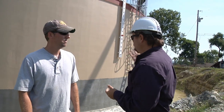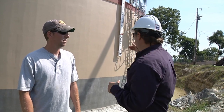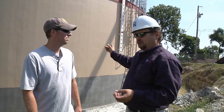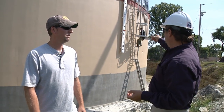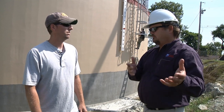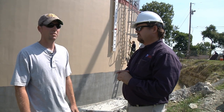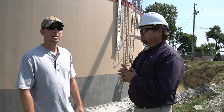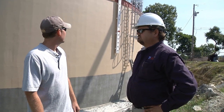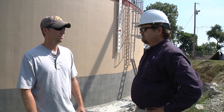Okay Ryan, well enjoyed that. That's amazing — you got to see the whole process of the tank all the way down to the Solarbee. One thing that Eric and I saw inside the tank is how the level indicator works. Right now we have an indicator right here that shows us the level by depth of the tank. The entire tank is 28 feet deep, and right now we've got about 18 feet — so we've got about 10 feet without water at the top of the tank at the moment.